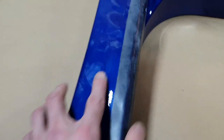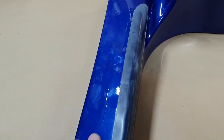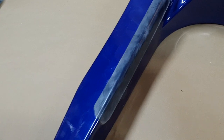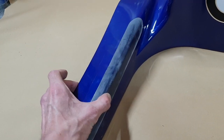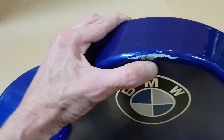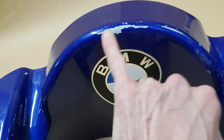So this can all bend. Now you can see a few crack marks there, just as the forces from the driver's head or whatever he was leaning against. You know, it's really thin. You can see it there in the paint. It's not structural at all, this carbon fiber. It's just something to carry the paint and contain the foam. Now obviously it has a huge burst pressure containment strength, but it's not designed for any axial forces in the Y direction, if you want to call it that way. Same with all parts of the headrest. This is all again soft. You can see it's really soft there, like it's really thin. So that's just where the helmet was chipping off it as you'd be driving around the track.